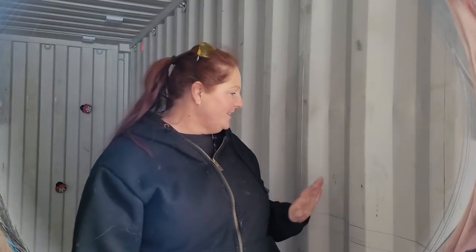And really chatty roosters. So what I did was I found center of my window, which was, so this is the window plus the 3 inches, which gives me my frame. So the window itself is 29.5, adding the 3 inches, found center here where I want my window, divided that in half and went off this direction and off that direction.